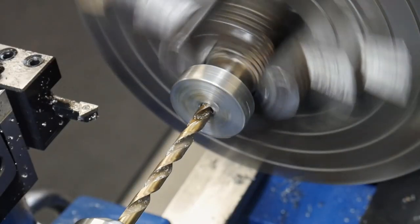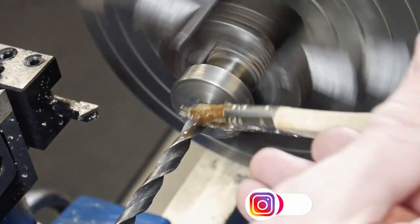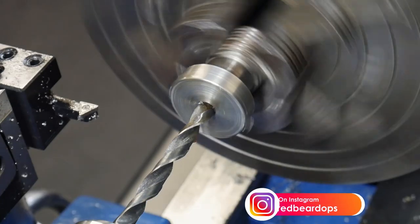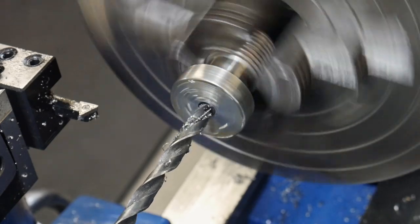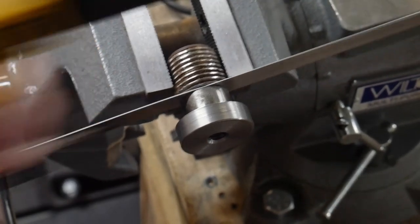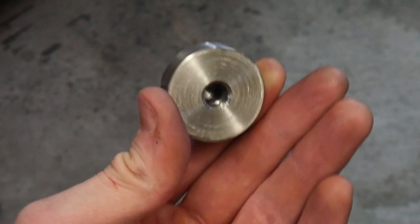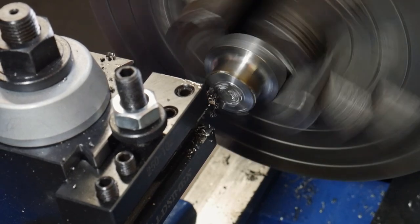I was slowing it down a little as my bits increased in size — I like drilling at slightly slower speeds. This material that the sucker rod is made out of is fairly tough, so I took my time and used ample lubrication with all the operations associated with this cap, especially during the threading process. Once we have it threaded, I'll cut off the male threads that were associated with the sucker rod, then flip this piece around in the lathe to clean up the other end.